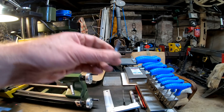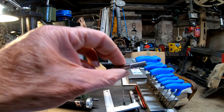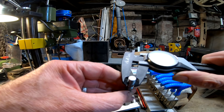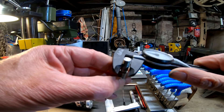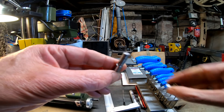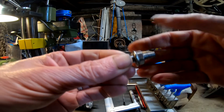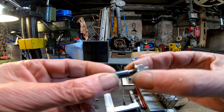So should you start with an outside diameter that compensates for the extrusion of the thread peaks? Here's my experiment: I reduced the outside diameter of a piece of M8 stock to about 6.6mm, cut the threads, and the peaks came out at about 7.1mm. An M8 nut fits on nicely and will clamp down, but it's a rattle fit — definitely wobbly. That's no good.